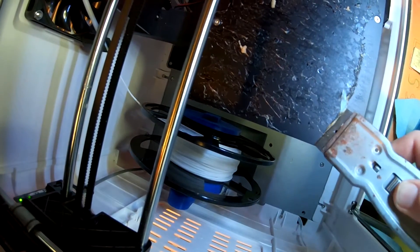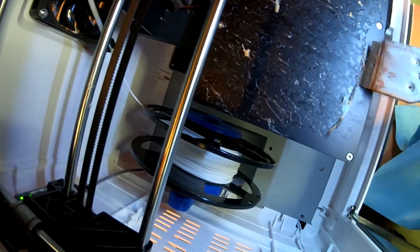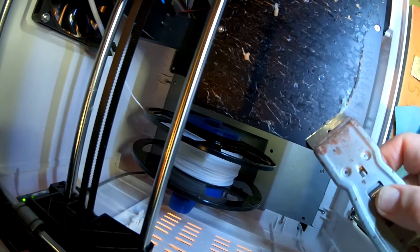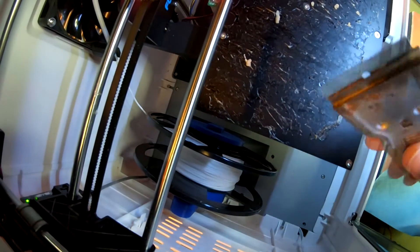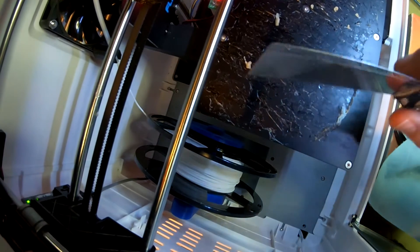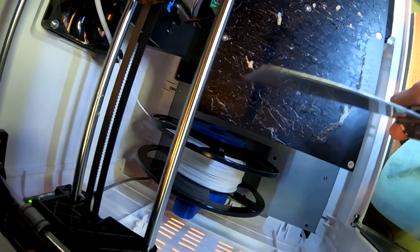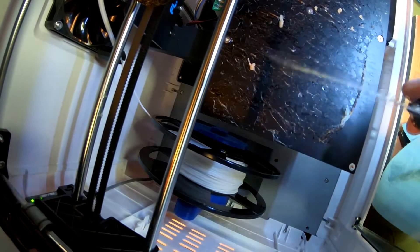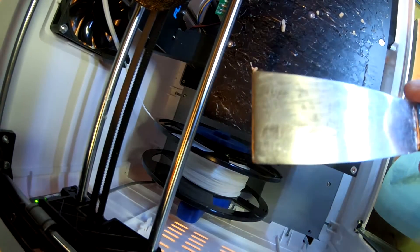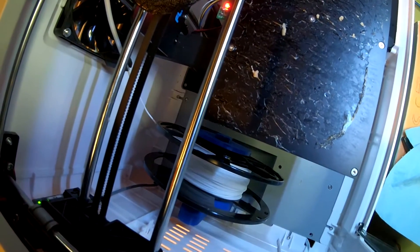This is a razor blade. We'll just keep working the glue toward a big blob and then hopefully we can remove it. Going forward, I can use this just to get the corner of the item and then use this to get it off. I also ordered a couple of different spatulas that might work better, that have rounded edges on them. Hopefully either that or just using the razor blade on the corner will get them off more reliably without slicing the bed again, which is annoying.